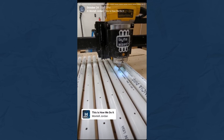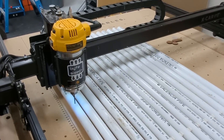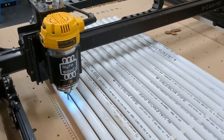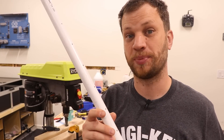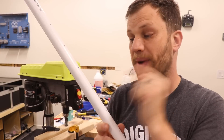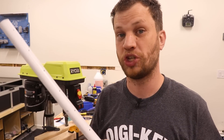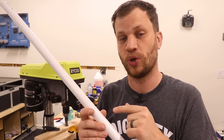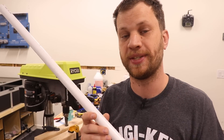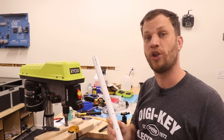This is where digital manufacturing comes into play. I'm lucky enough to have access to a CNC machine, and I figured out a clever way to use it to drill all these holes in the PVC pipe. I've got a small pilot hole drilled exactly 2.4 inches apart on all of the pieces of PVC. Now I need to make that pilot hole bigger so it can fit the LED light. Since I don't have the right collet size for a half-inch drill bit on the CNC, I'm going to do it by hand using a step bit on my drill press — it works much better than a regular drill bit on PVC pipe.